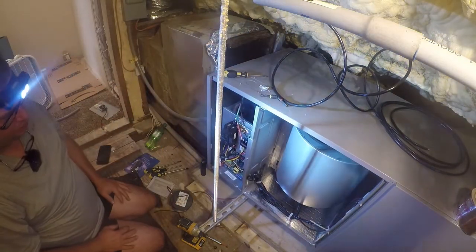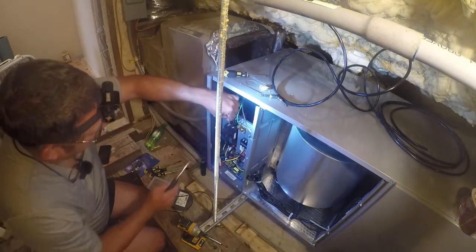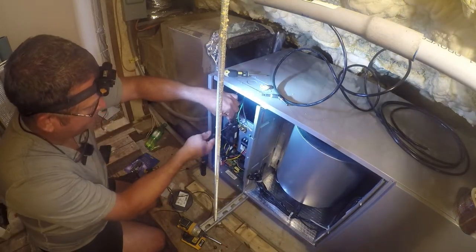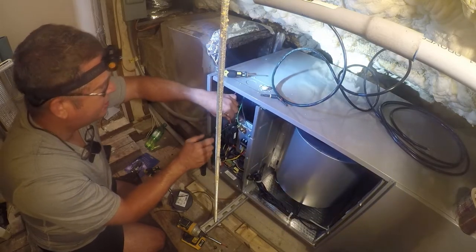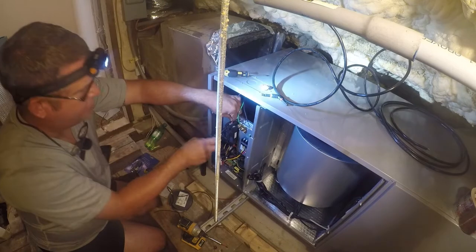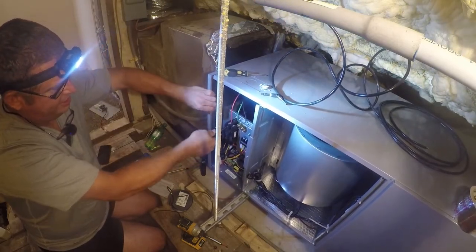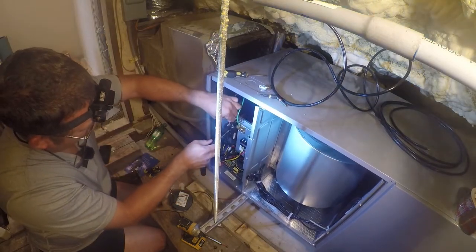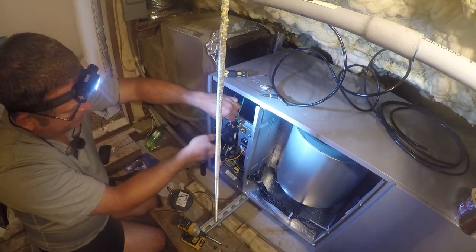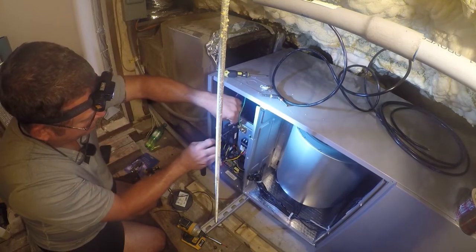You know, in the US, we do stupid stuff. So that's how I'm going to wire it, and I'm going to continue to call red L2 in my house. The other thing that could have been done is to run straight out of these lugs onto the right side. Now, these lugs are what I call crush lugs, so I don't feel like jumpering off these is that big of a deal.